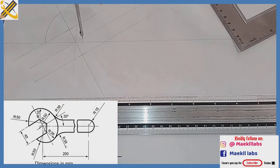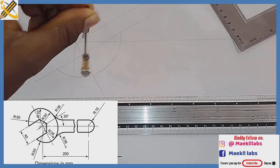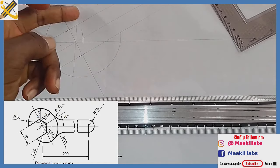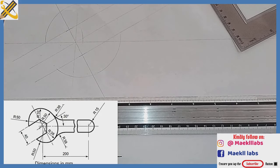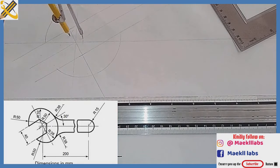Draw towards this manner with a thin line, then draw towards this also with a thin line — ensure it is drawn with a thin line. The radius of the arc joining this is radius 32. So 32 minus 50 is 18; pick your compass and measure radius 18. With radius 18, place your compass at the center of radius 50 and strike an arc on this line.